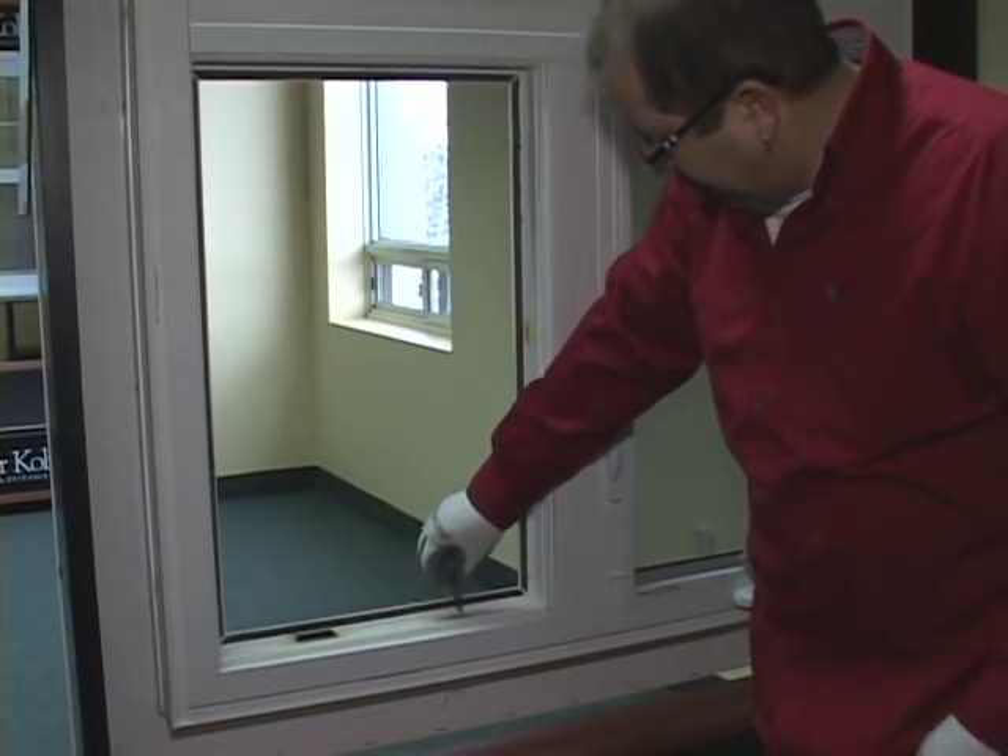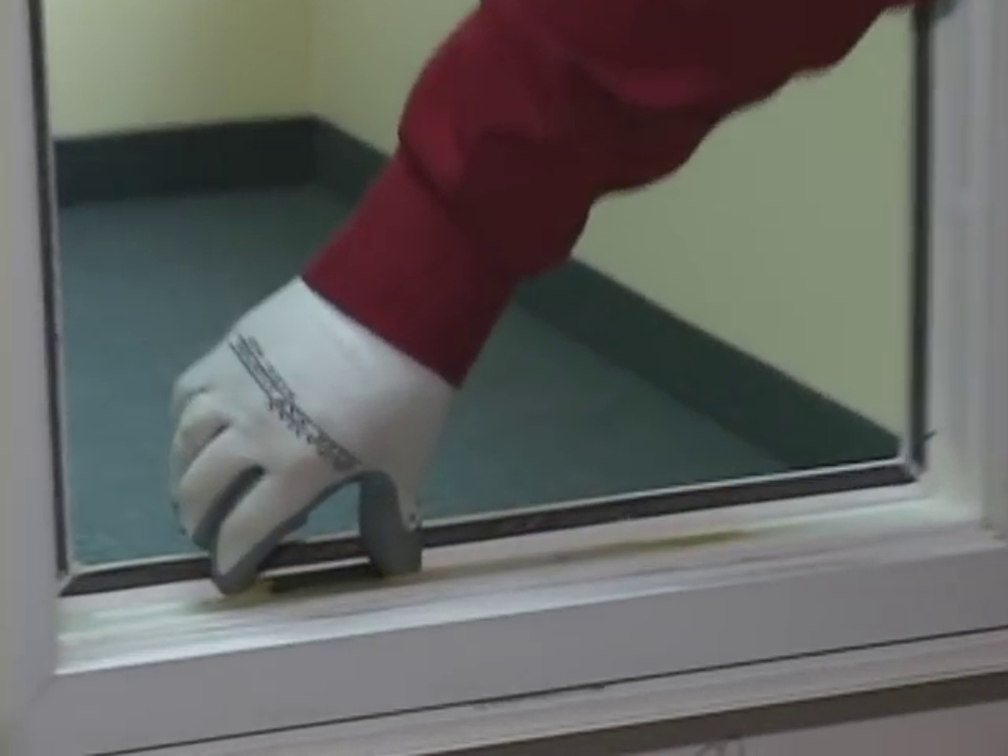The contact surfaces should be cleaned. Using a chisel, putty knife, or utility knife, remove leftover caulking or black glazing tape from the frame. You will also need to remove any remaining setting blocks. The surface should be smooth.